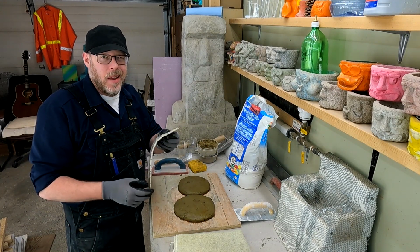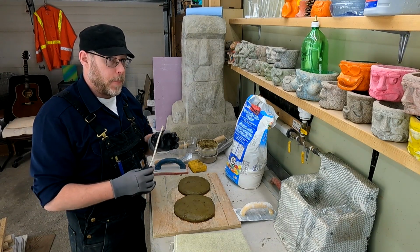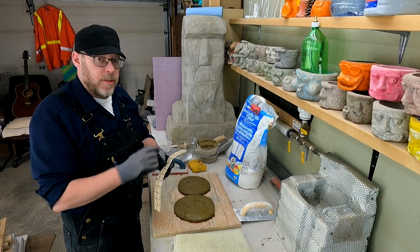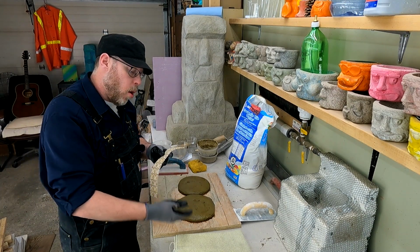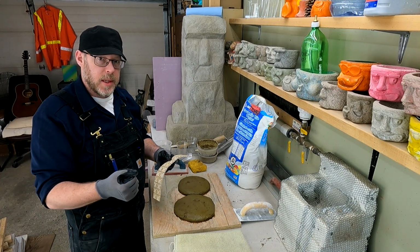Like, I mean, if you did, it probably works pretty well. That thinset's pretty aggressive stuff and it bonds pretty readily, but it would work a lot better if you back butter your tile. So the goal of back buttering is not to apply extra thinset. We're not looking for an extra layer. We have all we need already. Where we've troweled out the thinset, we've removed half of it with a notch trowel.